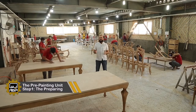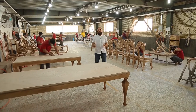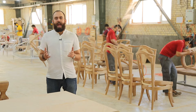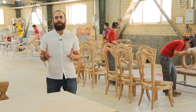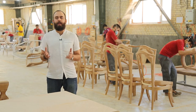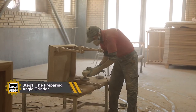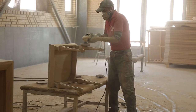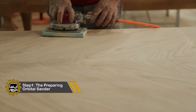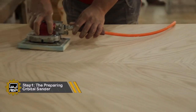Starting from the first subdivision — preparing before painting. The unfinished bare wood surface needs time to be prepared. According to an old adage, a paint job is only as good as the preparation that precedes it. The most effective tool in preparing bare wood is sandpaper. Sanding is started with a lower number of coarse grits and goes up to higher-numbered fine grits. We usually start with 80 grit.